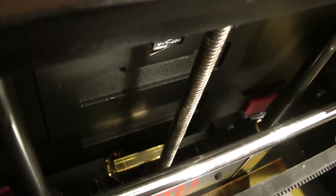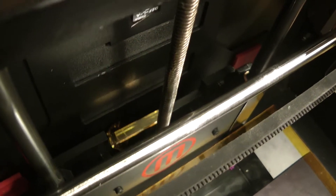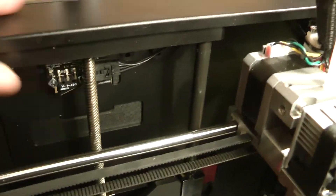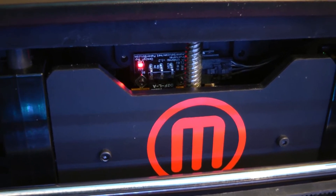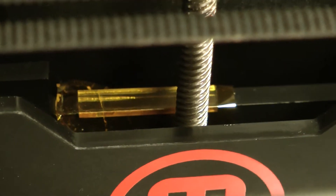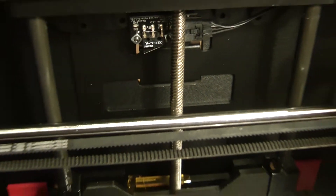The method I chose in the end was just to use a shim. Hopefully you can see that just down there — where you can see the Kapton tape, the yellow Kapton tape there. There's actually a piece of glass underneath there, the same thickness as my table. I just got an offcut of the glass and stuck it on the place where the limit switch strikes. So obviously the carriage is going to come up. You can see the piece of glass — a bit rough and ready, but it's working really well. So that's 2mm. If you had a 3mm glass plate, you'd use a 3mm shim or spacer. I've just taped that on there with Kapton tape and it's really solid. As that comes up, it triggers the limit switch at the proper place.